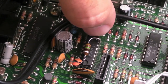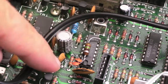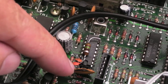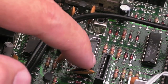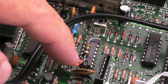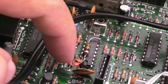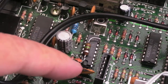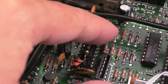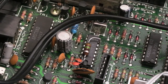So, not the top right-hand pin — the one below it on this side — and on the other side, the same thing: not quite the bottom pin but the one next to it, which is the ground. It's pin 8 to pin 17. Two caps in parallel, straight through the 15 microhenry inductor, and that should be it. I'm just going to reassemble this and give it a try.